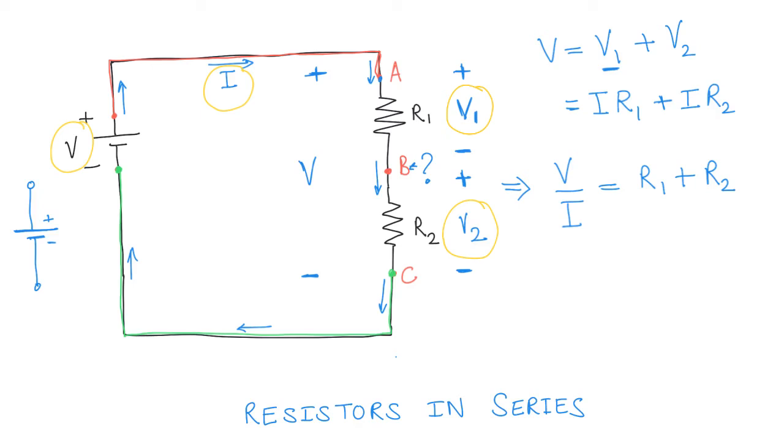So as far as the external circuit is concerned, if we divide the circuit into two parts, one which is this side to the left of the resistor network, we can combine the resistances. But if we want to know the internal behavior of these resistances, then we have to look at these resistances separately, and we can't just combine them because we would not know the internals.